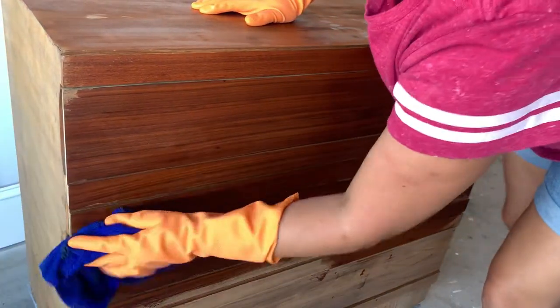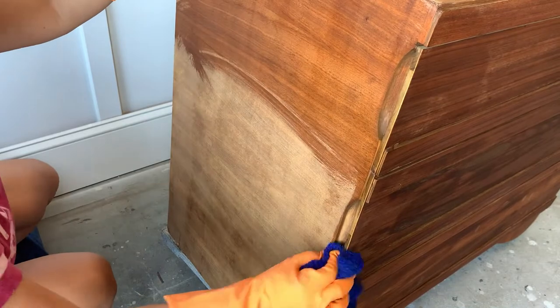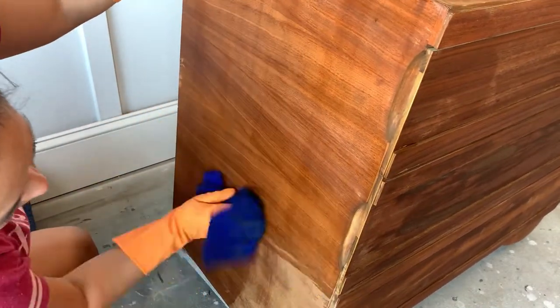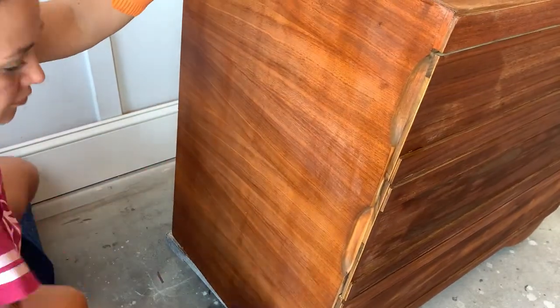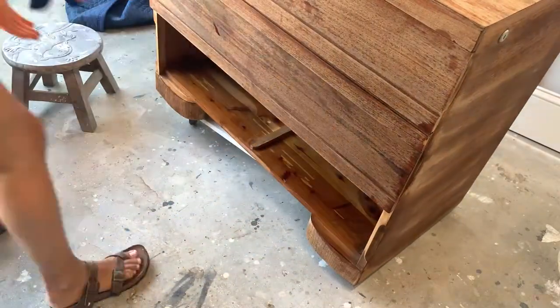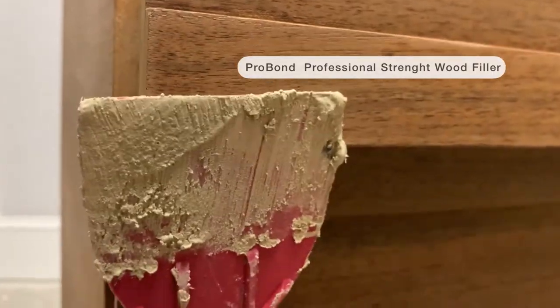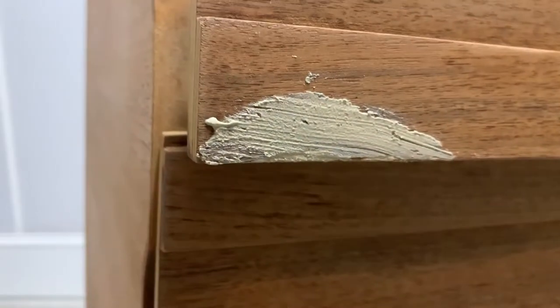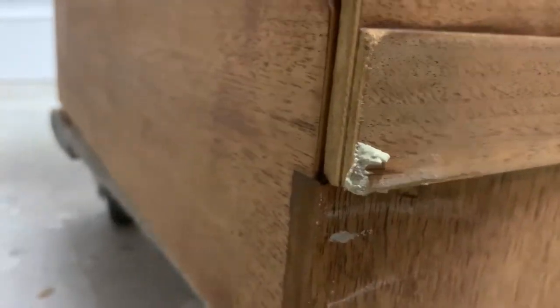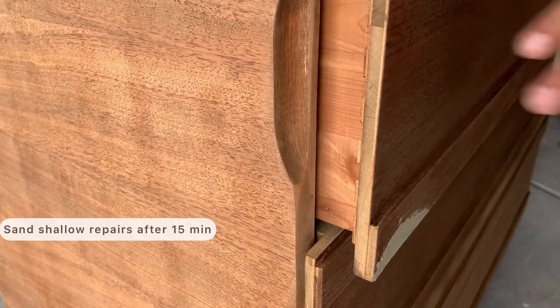It finally stopped, which meant that I could partially leave some of the wood unpainted. But due to the damage that this piece had, I knew I had to partially paint it, and I let the damage sort of dictate what I was going to paint and what painting design I chose for the piece. Before I even start priming, I need to let it completely dry overnight. Now that my piece is fully dry, I can start addressing those small imperfections with some wood filler. This wood filler is stainable, although I had stained wood filler to match the rest of the piece before. I'm afraid that some of these big chunks of missing wood veneer are located in highly visible areas, so it would be too obvious that there were repairs done — that is the reason why I decided to paint these specific parts of the dresser.